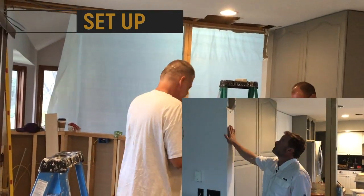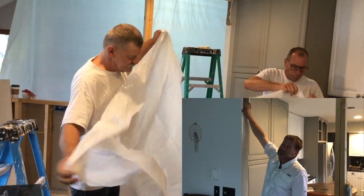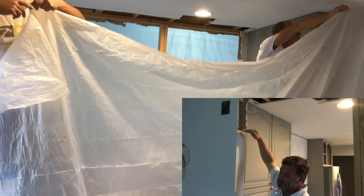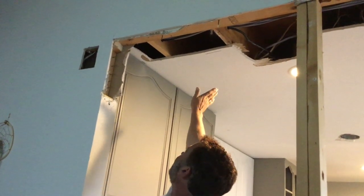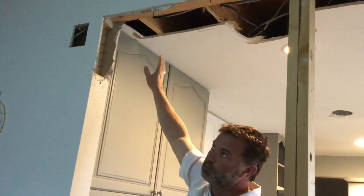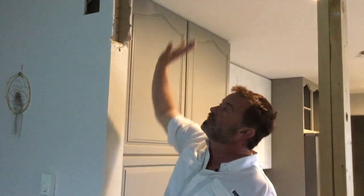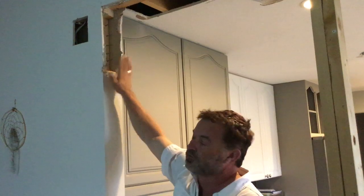Today's effort with opening up this room is a flush beam approach. If you look up here, this used to be the old header — the ceiling came over, then there was a drywall drop, and then it closed up the room. The owners asked if we could keep the ceiling flush and go up. What we're doing today is a flush beam approach. There used to be a drop beam here — you can see the remnants of it — and we're actually going to recess that beam up into the floor so they have a clean flush look.